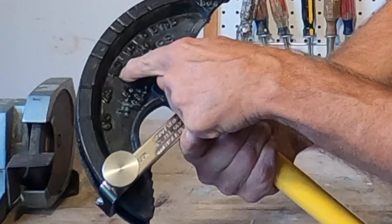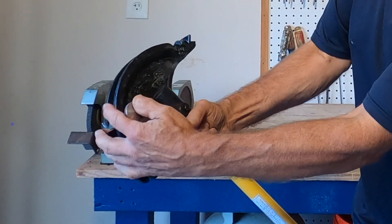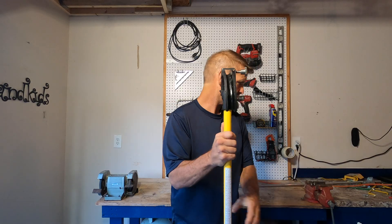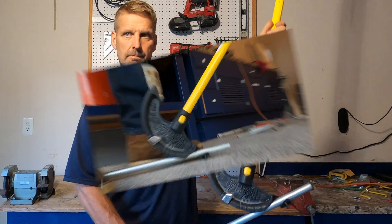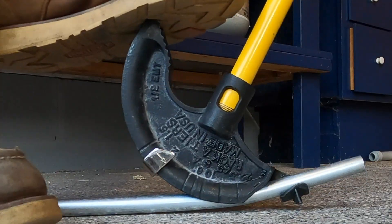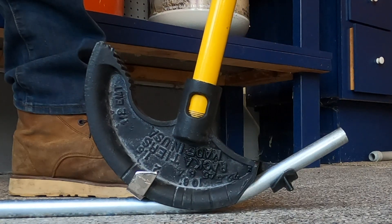So this apparatus here is going to make all that guesswork go away. Let's say I want a perfect 30-degree bend. I'm looking at my shoe here — there's the 30 and there's the little mark for it. This is the game changer right here: a swing arm stop. All you have to do — if you look very closely, you'll see the little arrow on this — line it up with the 30 and tighten down this little thumb screw and now it's all set. Want a 30-degree bend? No problem. Put it in there like normal. As I bend this up, this stop is going to prevent me from going past 30 degrees. Bend, bend, bend — you don't even have to look. I feel it stopping and that's the end of my bend. It's impossible for me to over-bend my 30. Here's my 30-degree bend — couldn't be more perfect.